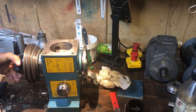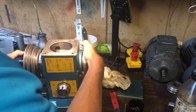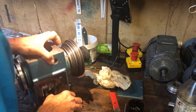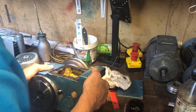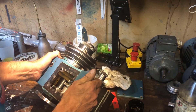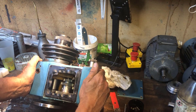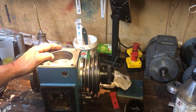Given the fact that this has been run dry, I'll have to test whether or not the spindle bearings are okay. They should not be fed by oil — I think they are greased and greased for life. That may be okay. At least I see some grease inside here, so I'll check the manual for that.